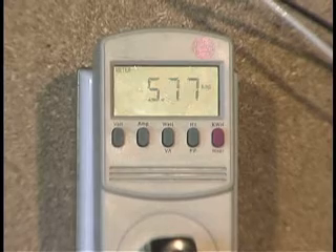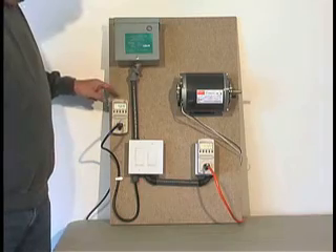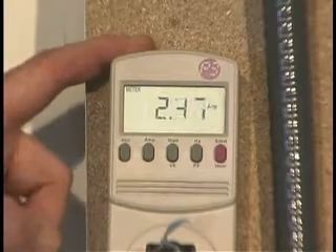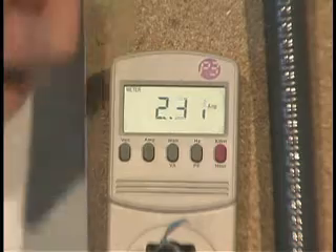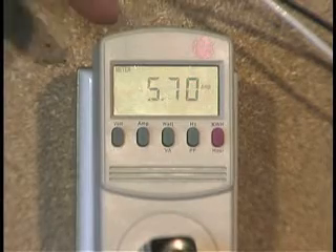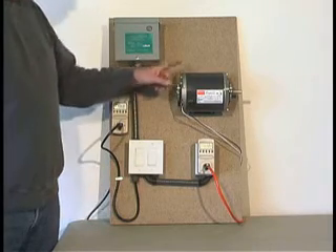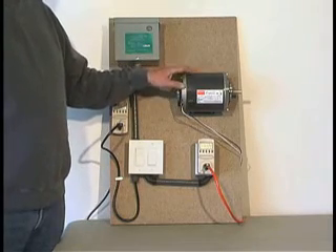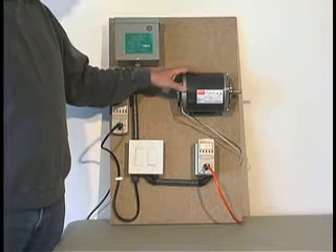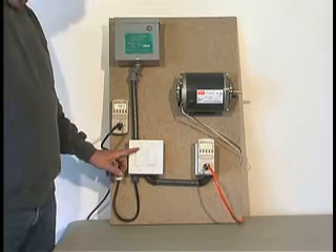So we have a fairly balanced load. With the unit on, the amperage being drawn onto the board decreases to 2.4, yet the amperage on the motor remains the same at 5.8. The motor is not aware of the unit being on or off. The same amperage, voltage, torque, and RPMs were tested at the University of Santa Clara and shown to be the same with the unit on or off.